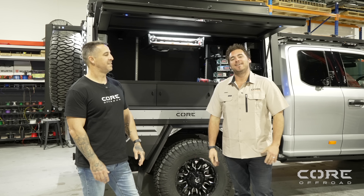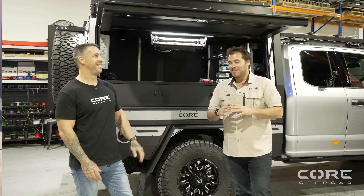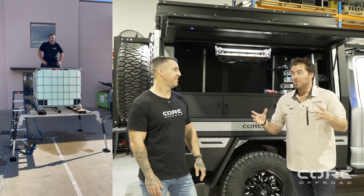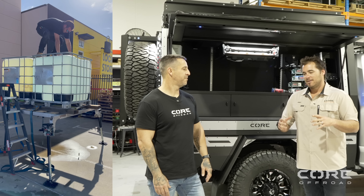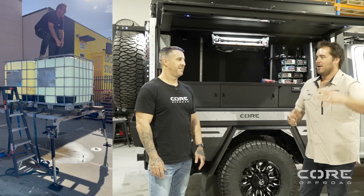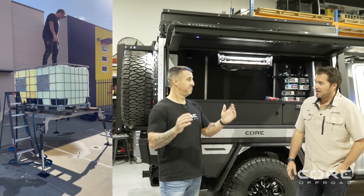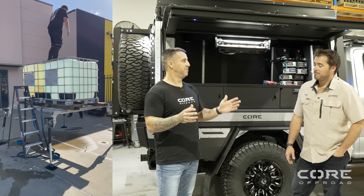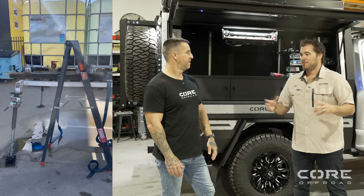A few of the other things we looked at was the loading and engineering side of things. We've got some photos and video of this — it's been engineered with a safe working load of 1,500 kilos. We took it to 2.2 tonne on our load tests, and Drew and the engineers did FEA testing on the subframe to find any hot spots. We put two one-tonne IBC bags of water on it and then got on top and swayed around to try and get that water moving, to see how much movement we could get out of the legs. The worst-case scenario — that water in the IBCs creates inertia as it keeps moving — is what we wanted to replicate as our worst-case test scenario.